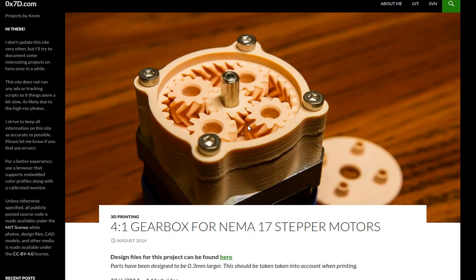Yeah, I tried. I took one of these gears here and I tried to convert it to solid, but I couldn't. Which means you can't subtract from STLs. They still have to be converted to solids. You can add to STLs by just superposing something on it and selecting both objects, but you can't just cut one from the other.